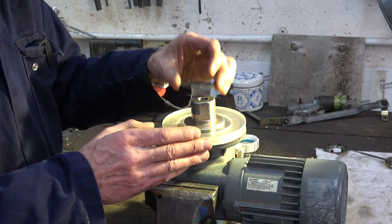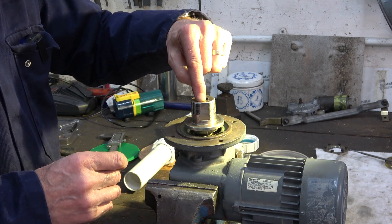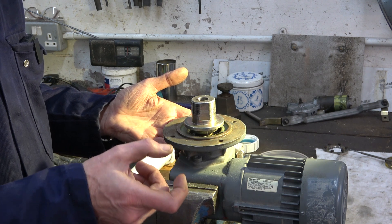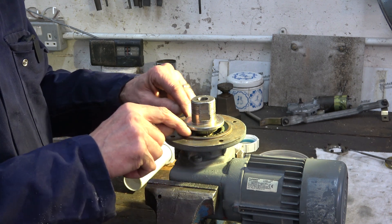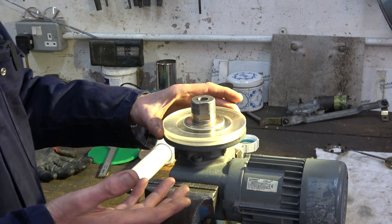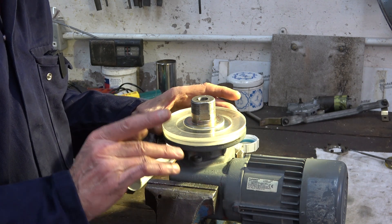What I can do now while I'm waiting for the copper sheet is make the channel for the purge gas, which if I need to use it would come up through the centre of the chuck. I'm going to drill a hole through this all the way down to the bottom, then drill a hole up underneath and press in a barbed brass tail end. The idea is the gas comes in, fills the cavity, and then comes up through the hole. It won't be gas tight exactly, but the gas will go along the easiest channel with no way of coming out the sides.